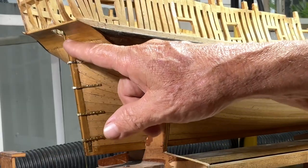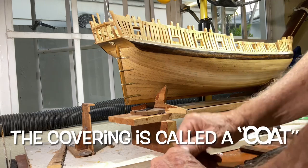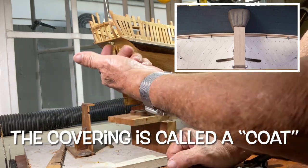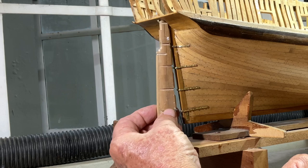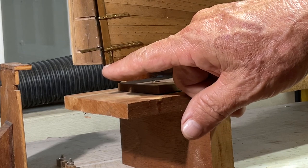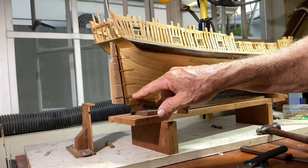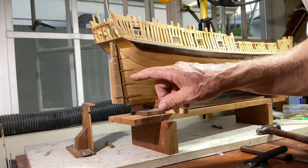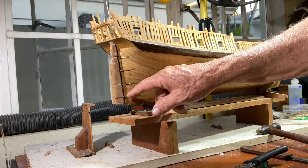For now I've left out this top one. I can stick a piece on - I certainly can't nail it on. And if I do put the sock on it, a little canvas bag that covers the rudder that prevents water from splashing up through the hole into the internal of the ship. This needs to come down just a little bit, about three or four inches. And it's telling me that I cannot cut these slots before this. We had to put the gudgeons in before we put the pintles in because this one lines up. This one might line up. This one does not line up. And of course this one lines up - so they would have to match the rudder.